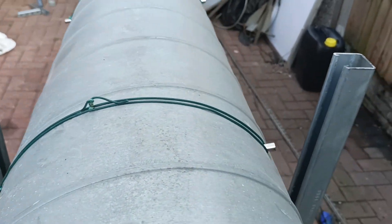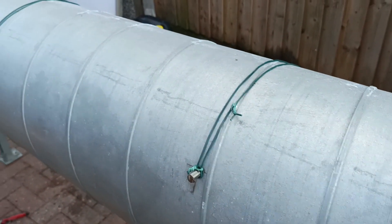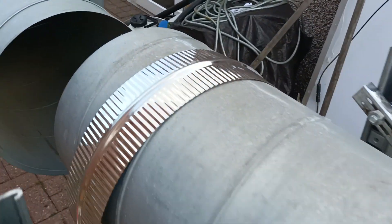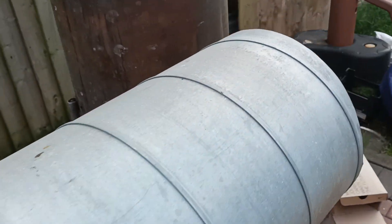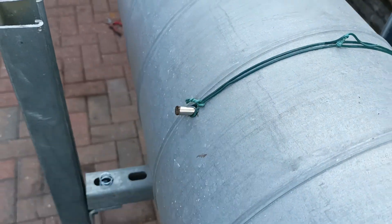Drilled holes in it and inserted stainless steel. Now, I was going to use zinc-plated threaded bar, but I thought to myself — after 3 or 4 days of steaming, or even a day of steaming probably, I'm going to get rust. Now, we're doing a natural finish on Helen, so what we don't want to do is have rust marks from where it's been sat steaming for 6 hours on the wood, because we don't want to be covering it. So a bit of wire around here, really tight — you can't move it — and that really secures the stainless steel bars.